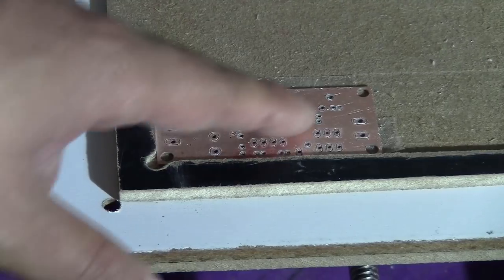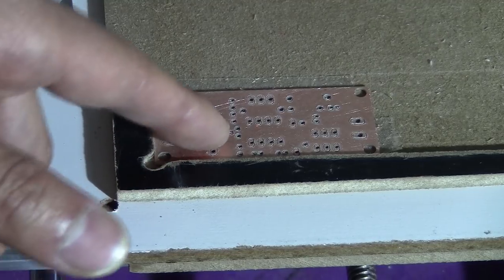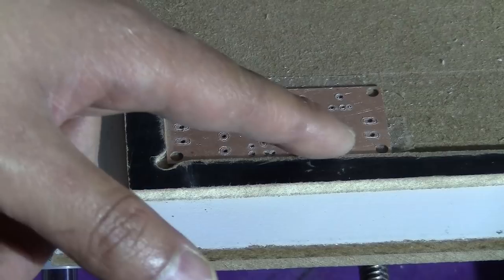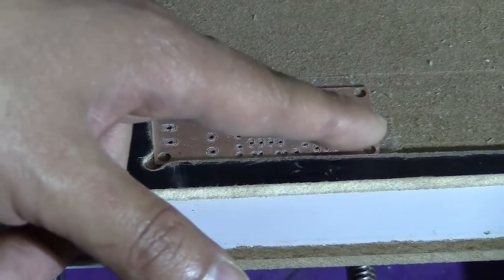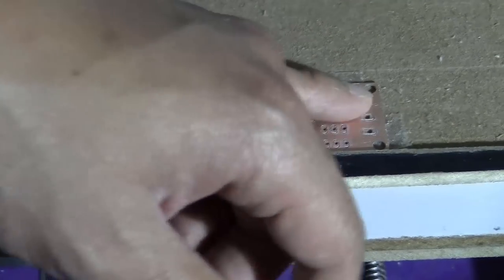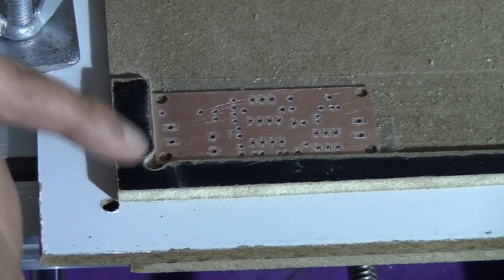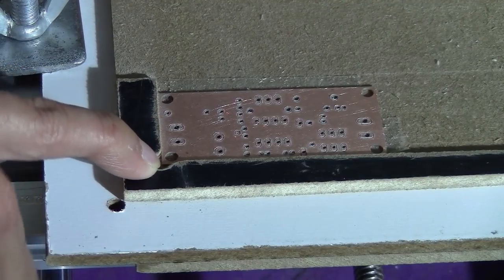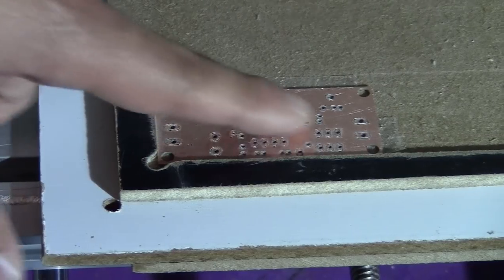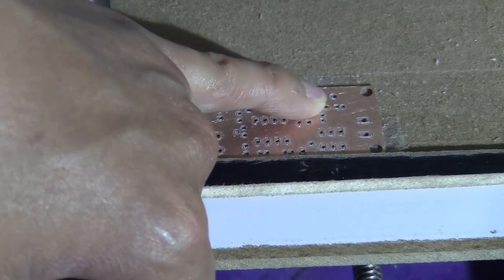Okay, so now after cleaning up, look at it closely. I can see that the copper is cut all the way through, and all the parts are in the right place. It's throughout the holes, almost like the holes are in the middle of the part. So it will mill correctly. So when I flip it over, the position of zero and zero were correctly found. So it's milled really nicely. Except that for the small pad, the copper is completely gone.